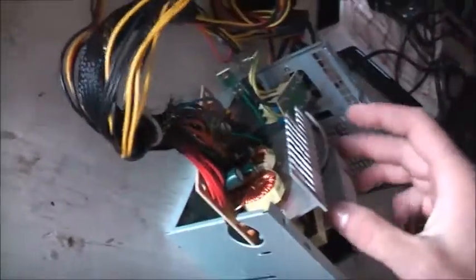I'm going to put, hopefully I've got enough of this value in Japanese capacitors, I'll put on this thing. Change all the lot. All those. Maybe those two, but I don't think they're any stressed. 85 degrees Celsius there. The board was made in 2011, but this was made in 2012. I'm going to find some spare screws, because he took all the screws out and he kept them, which is fair enough. That's alright, I've got plenty of bloody screws anyway. Let's recap it. It's even got a nice filter choke.